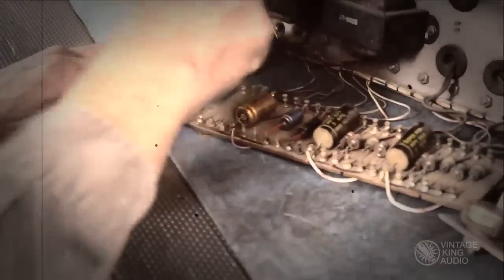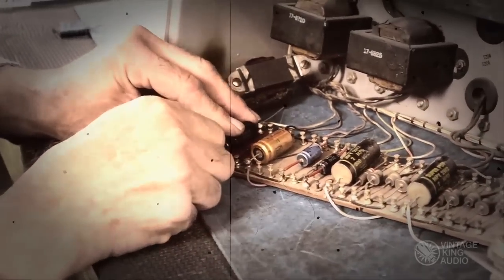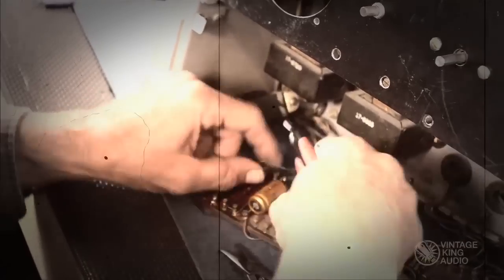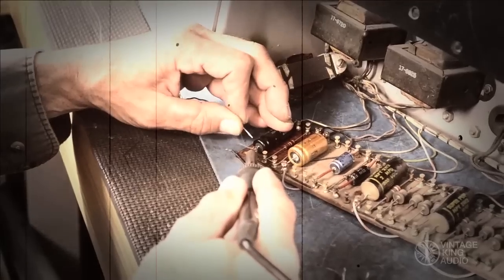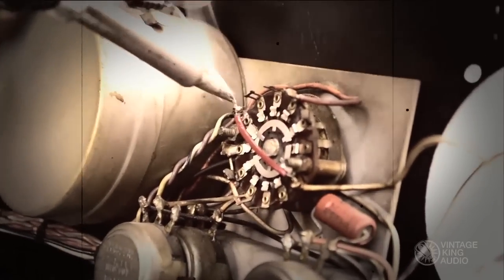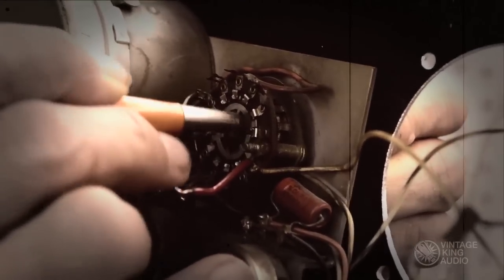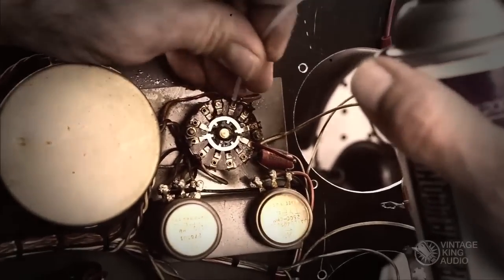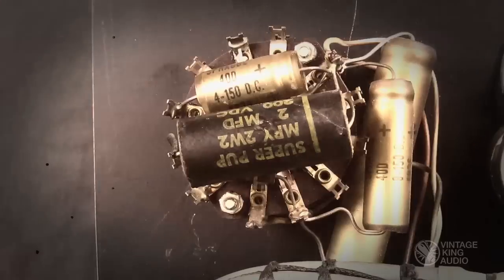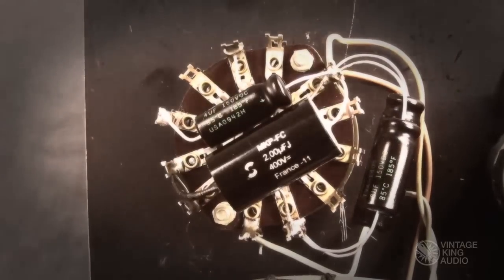By far the most complicated part of the restoration is the repair of the electrical circuitry. Step one is to do a full recapping of the unit, replacing electrolytics and coupling caps. Then all the rotary switches need to be refurbished, as they are usually oxidized. The switch wipers and all contacts are cleaned with a burnishing tool, not just washed with spray cleaner. Multi-layer switches are disassembled to facilitate restoration of all sections.